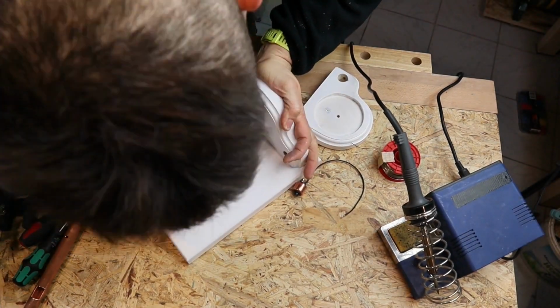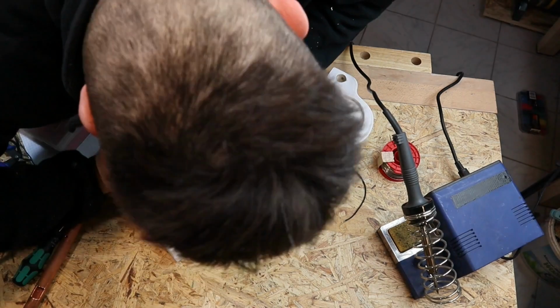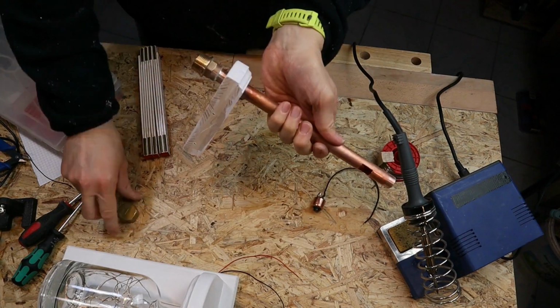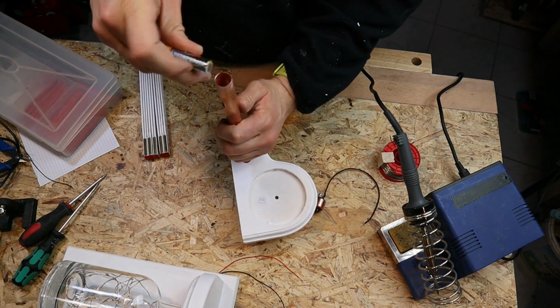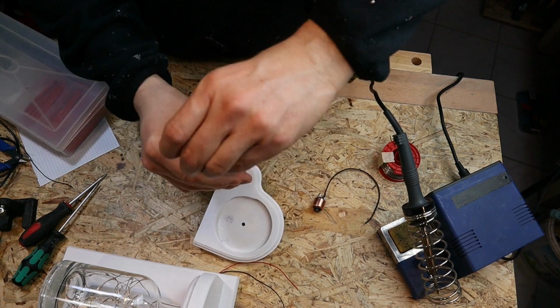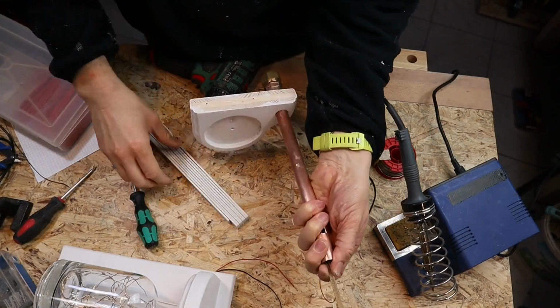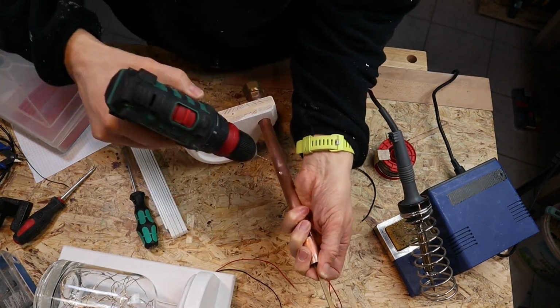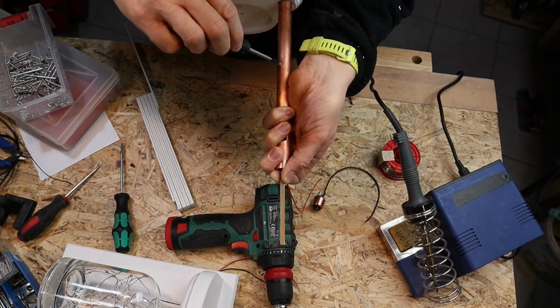Here I have to adjust the cable length a little bit in that way that you can't see the shrink tube but just the fairy lights. As we install the positive connector and hold it with a little screw in the copper tube, it's important that you first bring the whole copper tube through the lower bottle holder, otherwise the screw head won't fit through the hole for the copper tube.